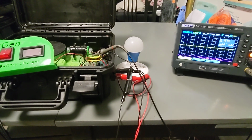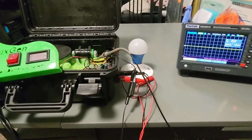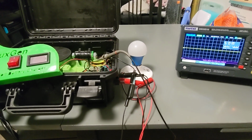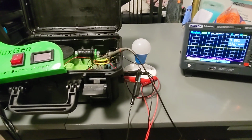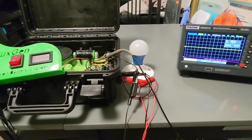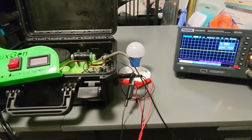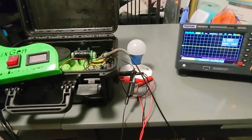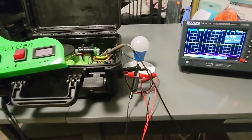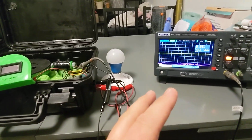So the way I see it lighting up tonight, I'm probably exceeding 60 volts, probably closer to 70, maybe even 75 volts DC. But that's pulsed. So in translation, we're looking at about 130, 140 volts AC if you're using a true AC waveform. So I'm not too worried about the voltages. It's the waveform that I'm getting.